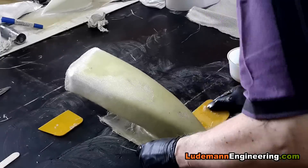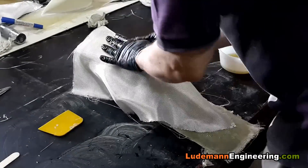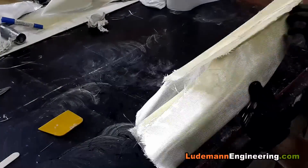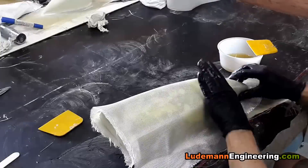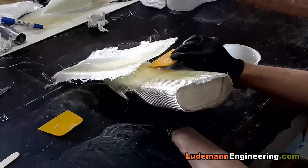Work to make sure there are no air bubbles. There's the fourth layer of cloth — trying to offset the seam on the bottom side a little bit side to side, so you won't get too much of a bulge in just one place.